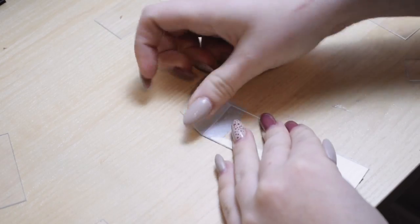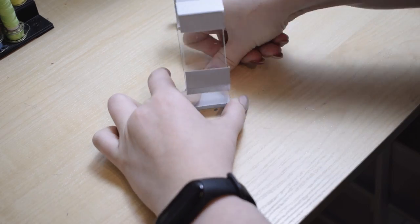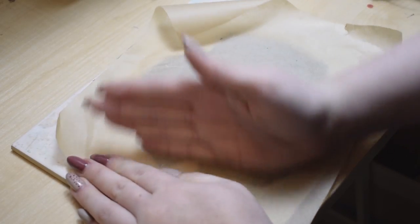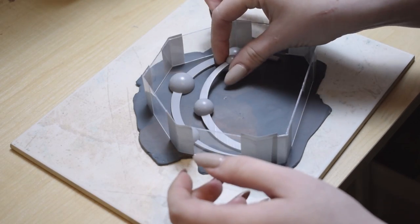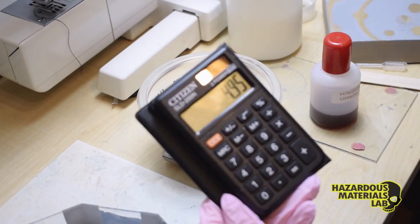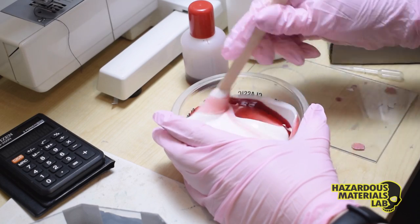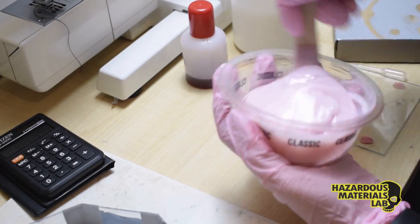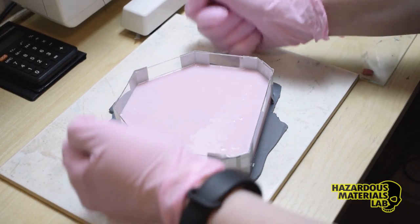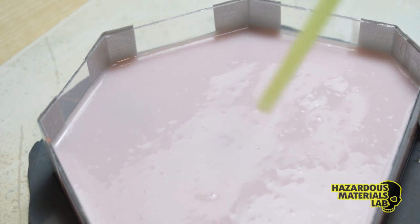Next I built my mold box. I thought it through to waste as little silicone as I could because it's expensive. I built it with tape, a thin acrylic sheet and plasticine. The plasticine is there to help make the mold level and help with releasing the silicone later. I pushed everything down into the plasticine as best I could and it's time to welcome you again to the hazardous materials lab. Starting off with silicone, I'm mixing it according to the instructions on the packaging. I try to pour with a thin stream to discourage air bubbles from forming. After filling the mold, it's time to bang the table like a madwoman to help the bubbles reach the surface. You can also blow through a straw to pop the bubbles on the surface.